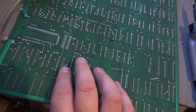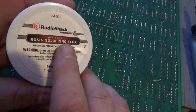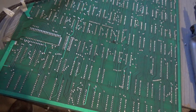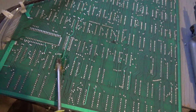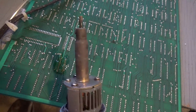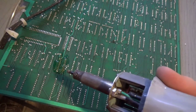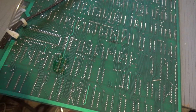This is the chip. Before I desolder it, I'm going to put some flux on here. This is just the standard flux — you can buy it at Radio Shack. Oh, there's no Radio Shack anymore. You used to buy the stuff at Radio Shack; now you get it online. Radio Shack is kind of going under. I've got my handy dandy desoldering iron. You can't go too crazy on the flux — well actually, go ahead and go crazy on the flux. It's cheap and it helps when removing and adding solder. And you can always wash it off.